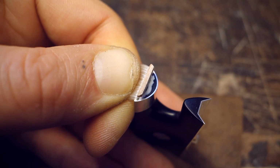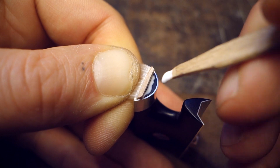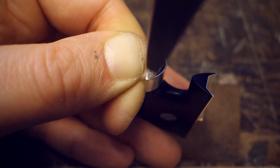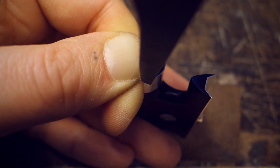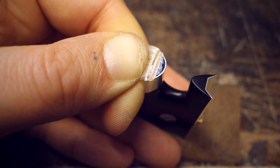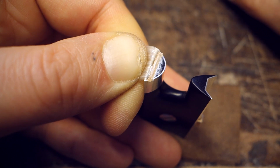Push the wedge inside with your fingers. Add more glue, this time directly on the wedge. Push the wedge all the way inside with a small hammer. The hammer isn't here to force, but to be sure you push the wedge in a perfect vertical position, with, and this is important, pressure only on the wedge and not on the ebony tongue or ferrule. Check that the flat part of the ferrule isn't bending. If it does, your wedge is too thick. Remove excess glue.